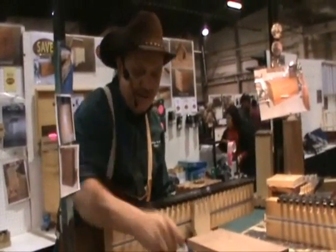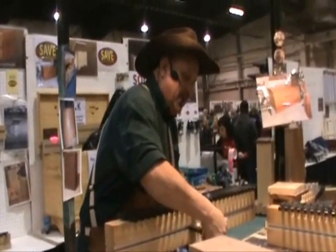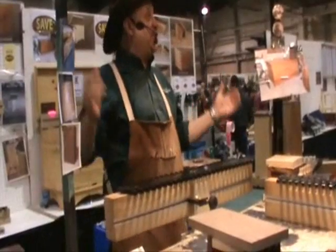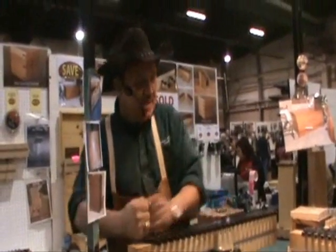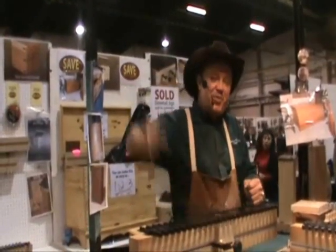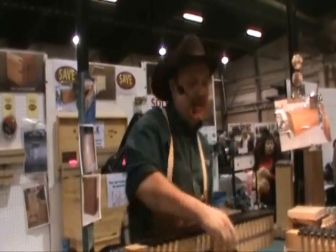Take only one clamp. Tighten it just finger tight. It's going to hold that whole jig up until you get the next clamp on. Always need to use 2 clamps. Now you have 30 inches to work with. Turn it upside down, you can use it right on the router table.